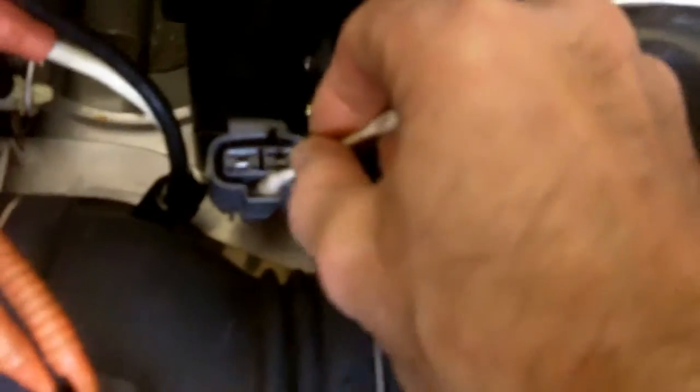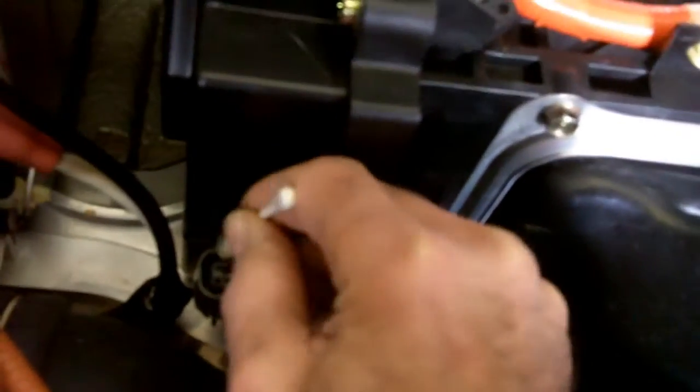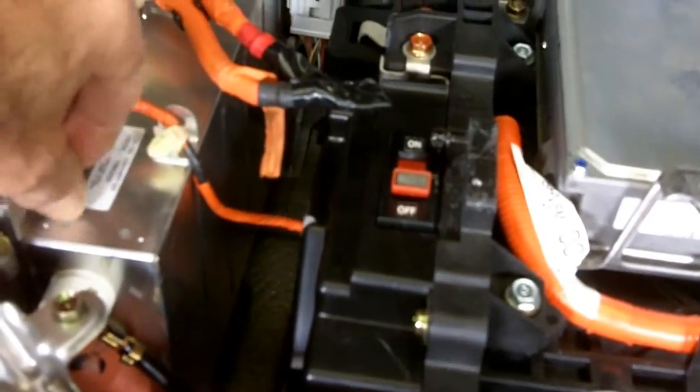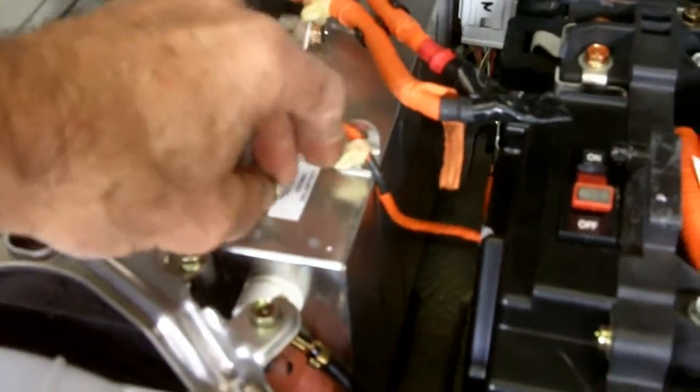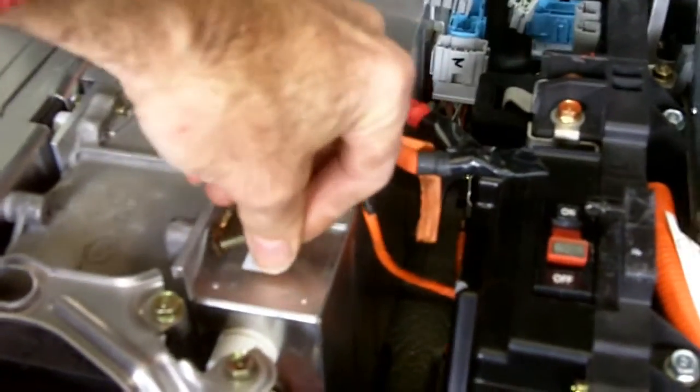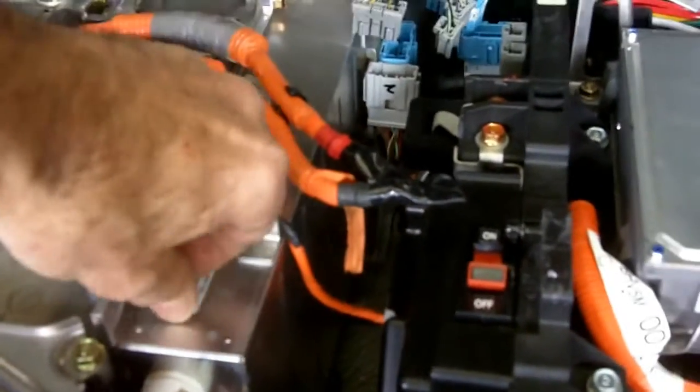I've removed the handle. I had some trouble getting this connector off, so I put a little bit of silicone on the o-ring in here that weather-seals it so it won't be so hard to get off next time. Let's snap that back in — snaps in really easy, though it is hard to get out. Now I'm going to replace the grounding wire. I stored the screw in its original hole; it has a little clip that goes right in there, and then we'll screw it down.